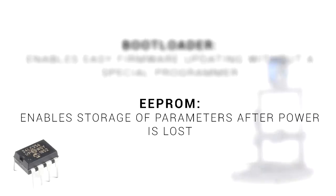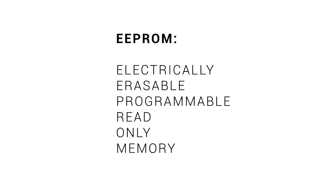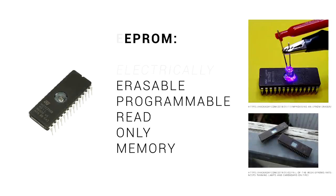So let's turn our attention to our second topic, the EEPROM. Essentially, this is a memory device that enables the storage of printer parameters even after the printer is turned off. EEPROM stands for Electrically Erasable Programmable Read-Only Memory. The important part is that first E, for electrically. On an EPROM with only one E, we can erase memory but not electrically — those chips had a little window on top and required UV light from a special eraser, or leaving it in the sun. And that's not going to cut it for on-the-fly 3D printer settings changes.